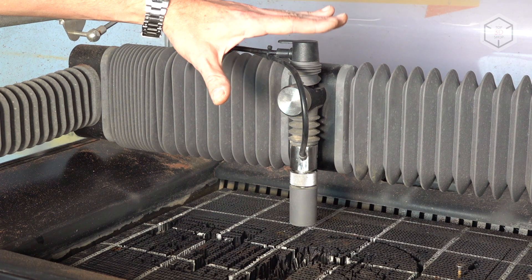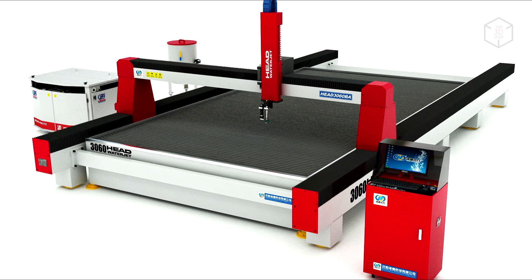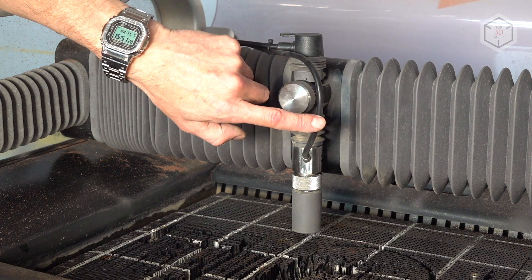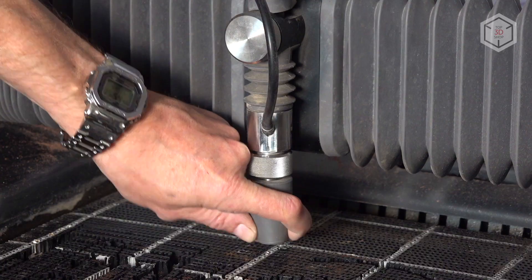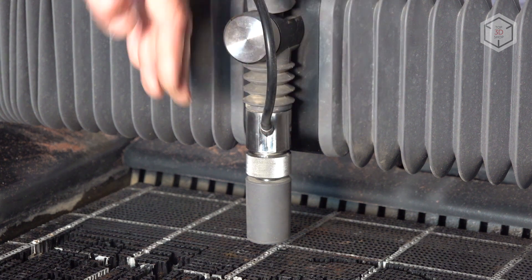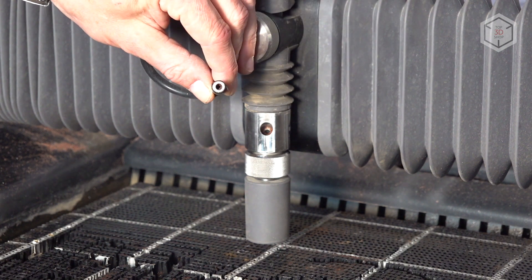The lightweight, compact cut head has an extremely simple design. A high-pressure tube is connected at the top under the cap, and Wazer's working pressure is 320 atmospheres — 10 to 20 times lower than industrial machines, but still enough for most cutting needs. The top of the head holds a high-pressure nozzle which feeds water into a mixing chamber below, where abrasive is mixed with water and directed to a second nozzle. This second nozzle is a consumable, since water mixed with garnet wears it out over time. A rubber cap on the lower end protects the transparent lid cover from splashes. The two nozzles essentially form an ejector pump with no moving parts — the abrasive is sucked into the mixing chamber by the pressure generated by the water jet.